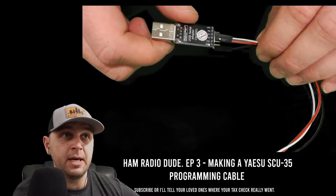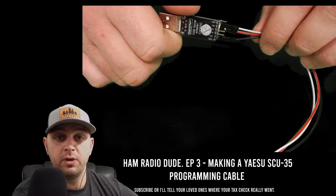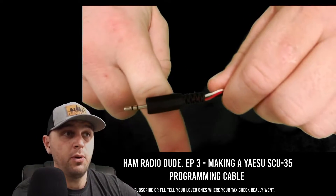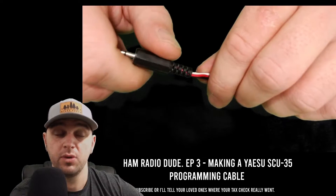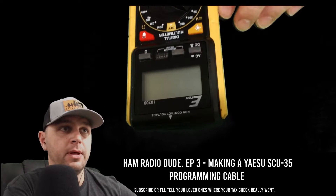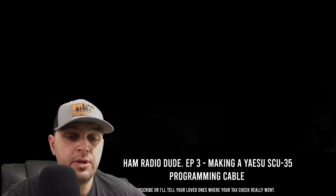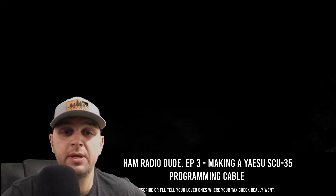The USB serial adapter is the CH340G — you could also use the CH340 without the G. You're going to need about two feet of cable, though cable length depends on how long you want it. You'll need a 2.5mm stereo jack, and inside the stereo jack goes a 1N4001 diode. Not required but I'll be using one: a multimeter. Also not strictly required is a soldering iron and solder — in theory you could use a breadboard and jumper wires, but be careful not to unplug anything while the radio is programming as you could break your radio.